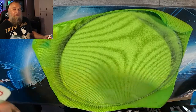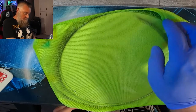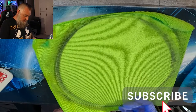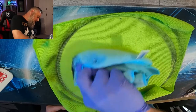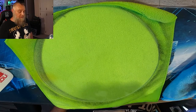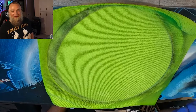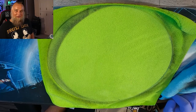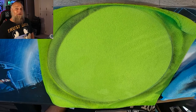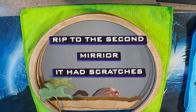The Novus Number 2 went ahead and took off all the mirror acrylic coating. The mirror coating is not in the acrylic itself — it's just on the back side. Let's see if we can see any scratches underneath... no scratches! There are still some mirror parts remaining — let's go ahead and try to get it all off. This goes to prove: when the directions say test in an inconspicuous spot, actually do it. I learned the hard way so you don't have to. Luckily I have more mirror acrylic, so we're going to throw that on the Long Mill and get it cut out. We're also going to paint the rest of the frame.